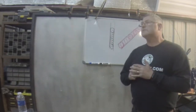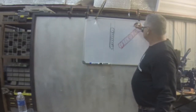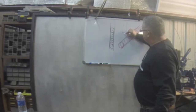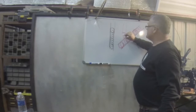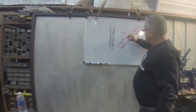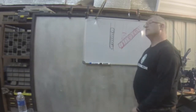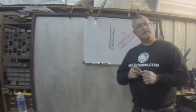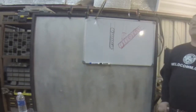Your arc gap. The distance between your work and your welding rod — your little droplets are coming out of here — the farther the distance between your actual puddle and the rod, that makes your weld hotter. How do you make it colder? Closer. Jam that sucker right down in there — that makes it colder.